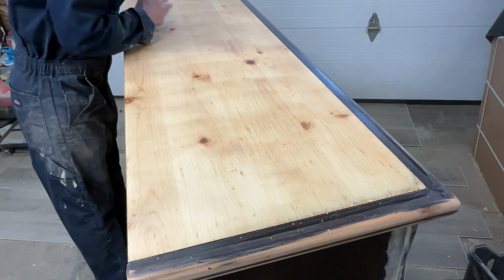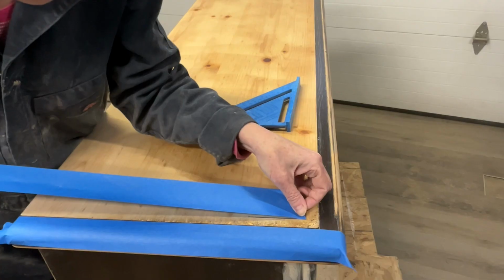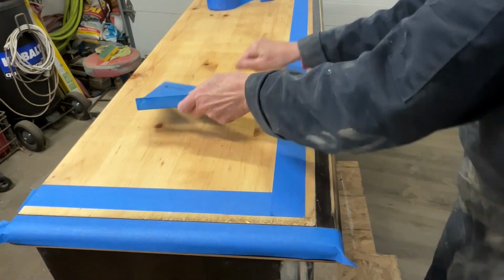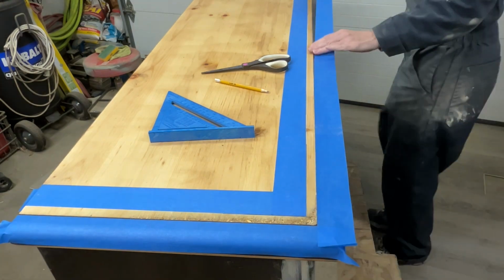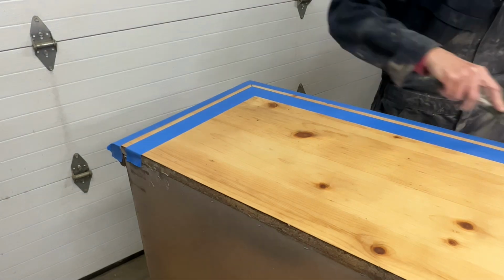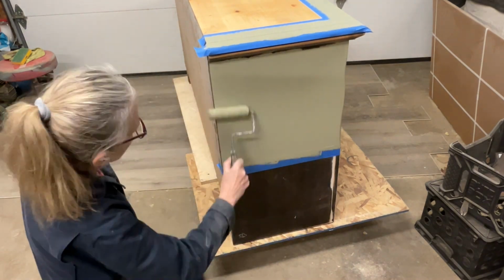However, when you go back to stain, sometimes things are revealed. On the drawers, more scratches and swirlies were revealed. Now here, I believe, was already like this before I sanded it. And I know that sounds like I'm making excuses, but I sanded this all over. I think the veneer was just damaged in that corner. But there were other places as well, and maybe it was me, but I decided I was going to paint some trim around the edges so that I could still reveal some wood, because for me that's always the end game. It's reveal as much wood as you can.